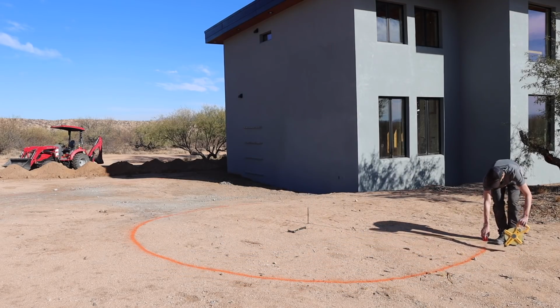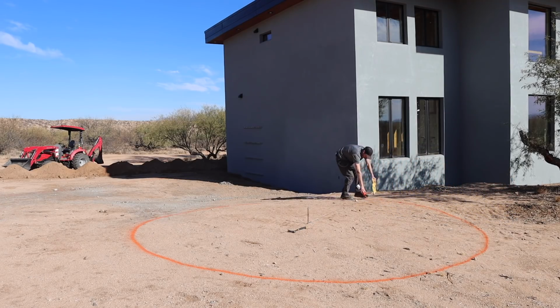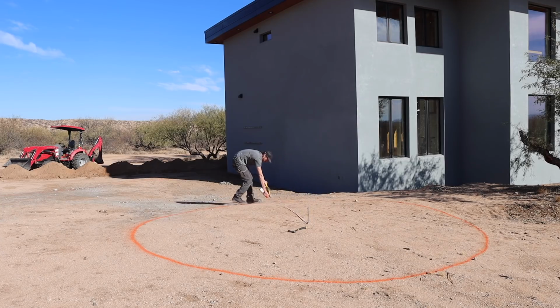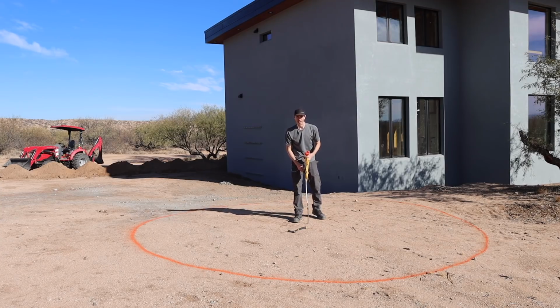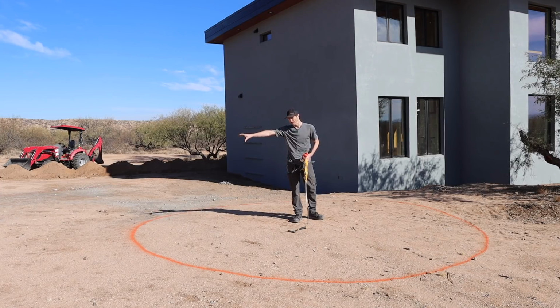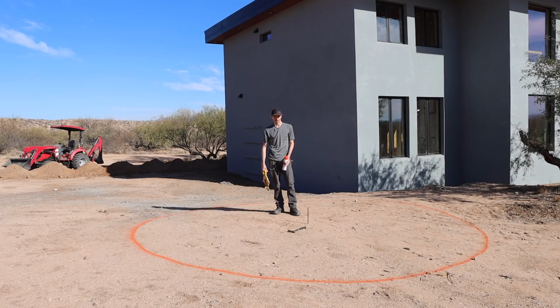So if I'm doing site prep or anything like that, I know basically where the edge of the tank is. When I do the site prep, I build the base of the tank 3 feet wider. So if the diameter is 17'1", then I would do the base material for the tank at 23 feet. So there's 3 feet of just the fill material that we use around the entire tank. We just use 1/4-inch fill material, so it's pretty basic stuff, but it gives a good solid base for the tank to sit on.